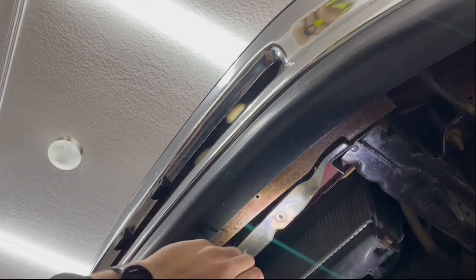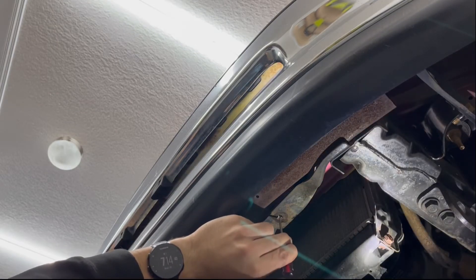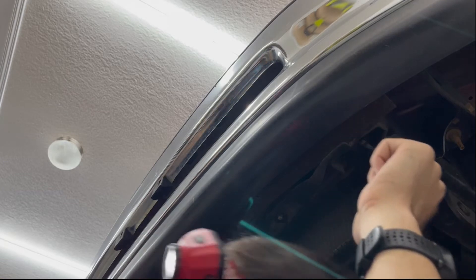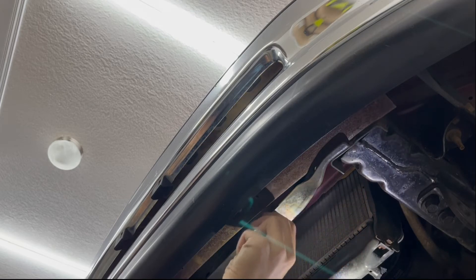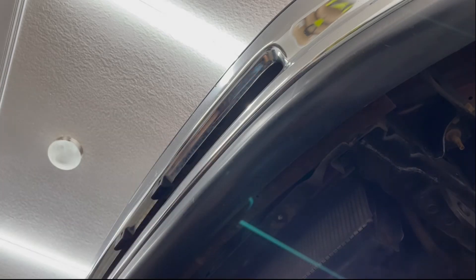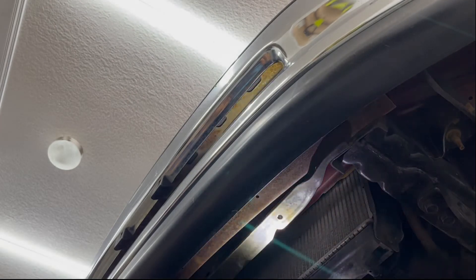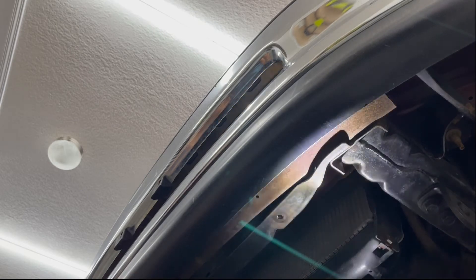Okay, that's much better — it's actually flush with the top of the hole where the threads were. I'll use the hammer — I know it's overkill but it's the smallest one I've got — just tap that piece off. That worked perfectly; I didn't manage to do that on the last one. Now if we use our test bolt — just did right in — look at that. Perfect. Helicoils are actually pretty easy to do. That thing was super stripped out and now it works like a charm.